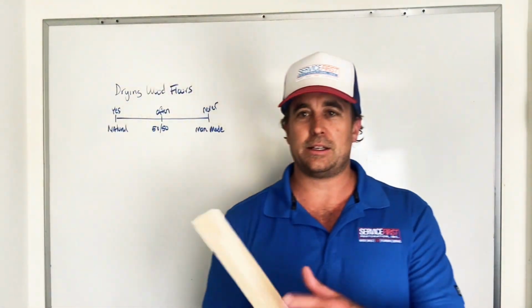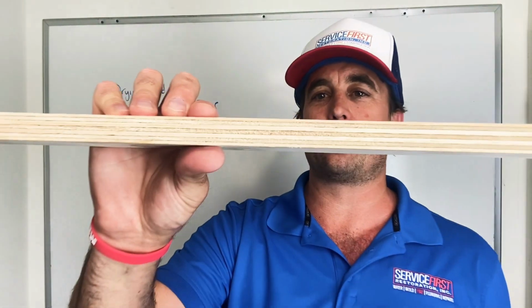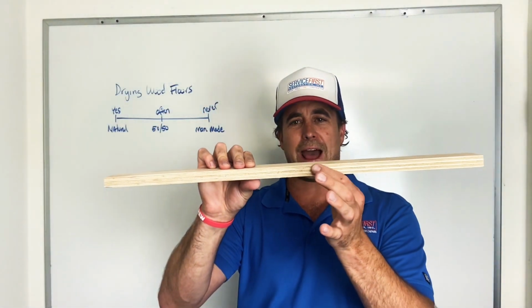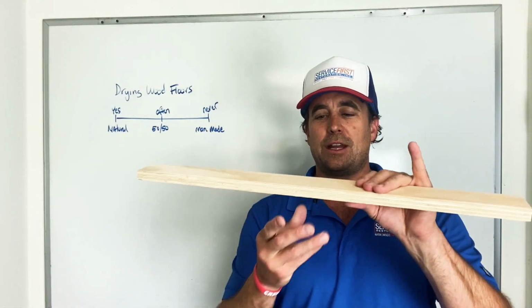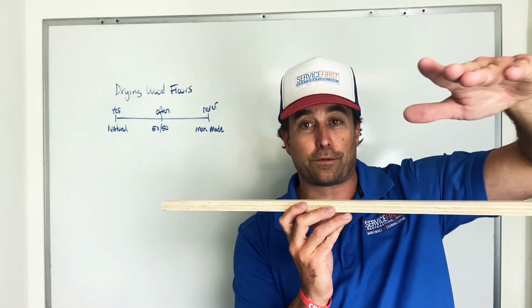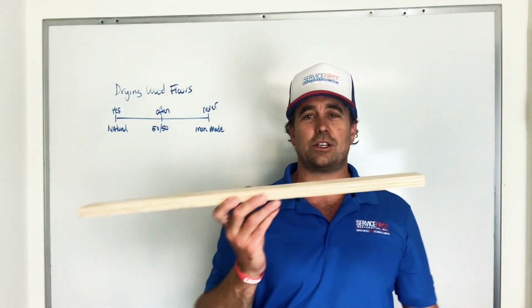What they do is, it's called engineered wood. And on this engineered wood, you have basically, I'm going to simplify and call it a plywood bottom. If you see this plywood here, it's got layers that have been composited together with glues, etc. So there's a man-made aspect of this piece of wood. So when you add those additives to the wood floor, it makes it more difficult to dry. It doesn't mean you can't dry it. So when you have an engineered wood floor, you've got a piece of plywood, a partially man-made product. And then they put a veneer, 4 millimeters. The more expensive the floor is, the more millimeter veneer finish on top. And that is going to be a natural piece of wood on top, okay? And so this here is called engineered wood floor, right in the middle.